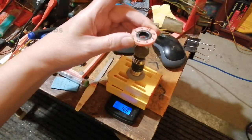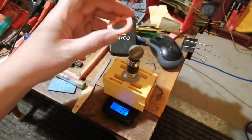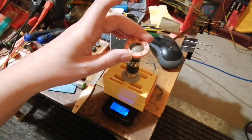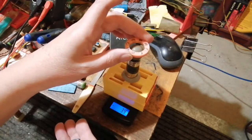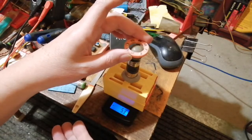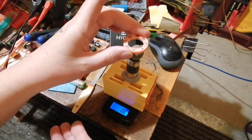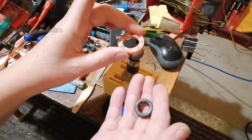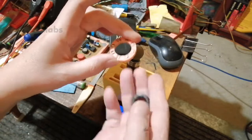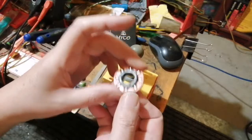Obviously without the ferrite ring in it, it's not going to be an iron-attracting thing. You can see that without the iron there, it's only about 4 grams, 5 grams attraction, but it's still deflecting a field. But we can't do it without the ferrite ring, because the ferrite ring is what's going to focus the fields that we want from these magnets up. So we have to have the ferrite in there.